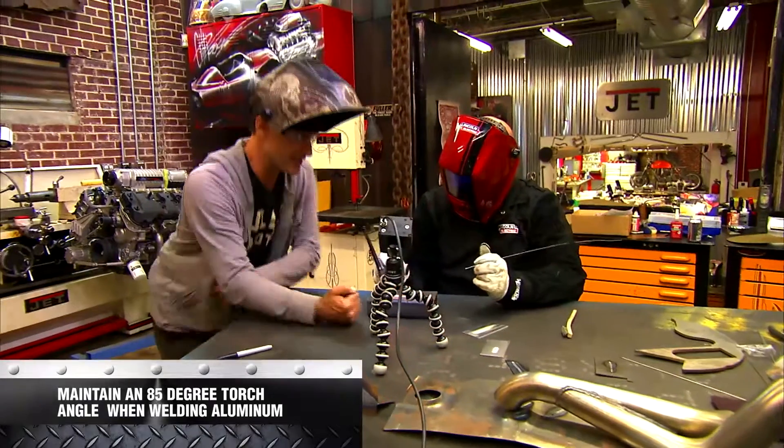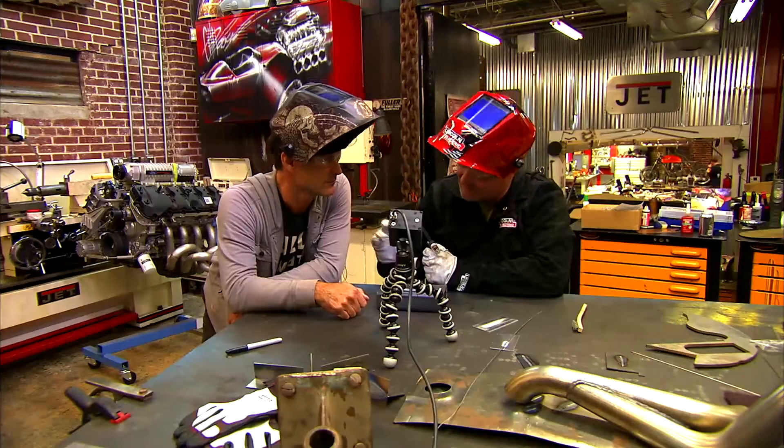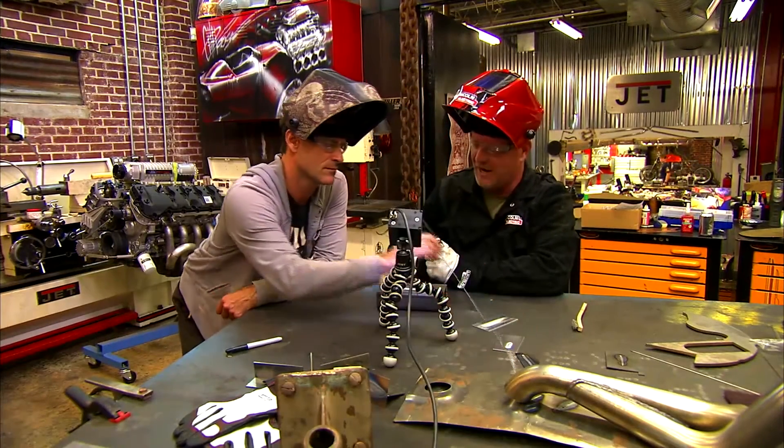You can really see it in the camera. That aluminum likes heat — get on the heat and go. A lot of times people have a hard time starting it because they're fiddling into it. You've got to hammer that heat.